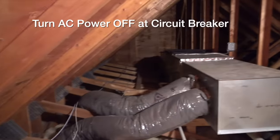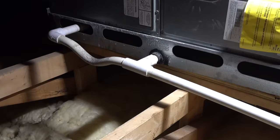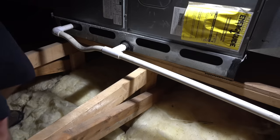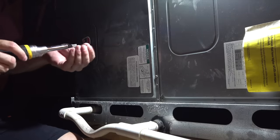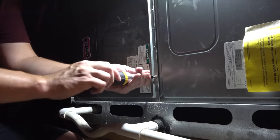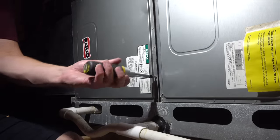As we go up to the attic, always remember to turn your air conditioner's power off at the circuit breaker before doing anything. Now in front of the air conditioner, what you're looking for is this piece with a little bend — it's called a drain trap. More than likely that's where the clog is, because it holds water and you get buildup in there. The problem is we can't get into that line to clear it because it's all glued, so we're gonna start by taking the door off the air conditioning system.